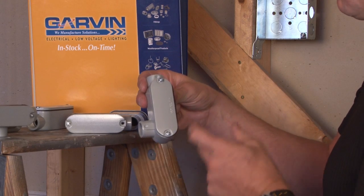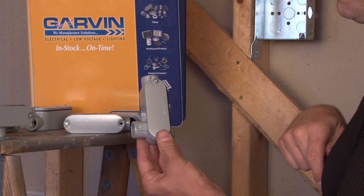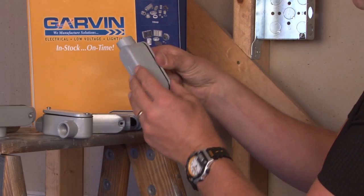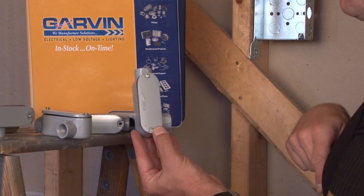This particular version with a removable cover and gasket would be an LL — to the left when a 90 degree turn to the left is required. With the same logic, this would be an LR conduit body for a turn to the right.